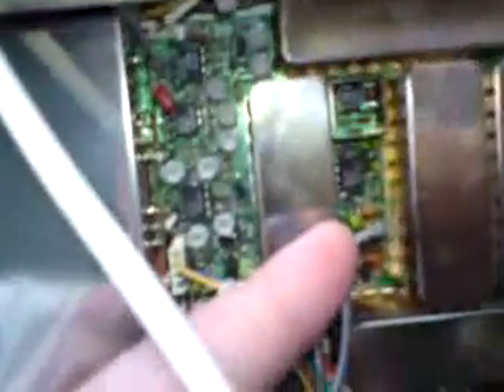There's a very simple mod — detailed elsewhere since the video resolution isn't that great — but this little inductor down here just needs a little snip, and you don't even need to remove the board. Just get in there and snip that little choke, and that removes the DC bias from the output. It's a nine volt DC bias originally used to drive the TV decoder. If I ever need it back, I can just put a blob of solder on it to restore the DC power.